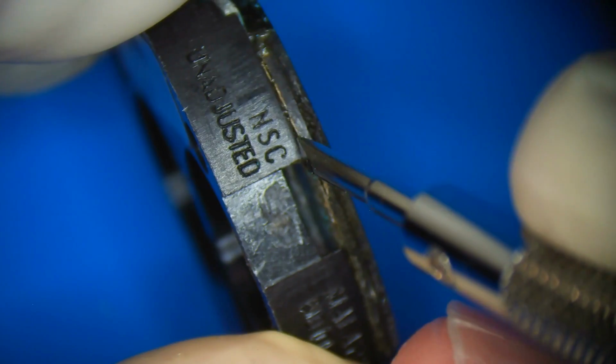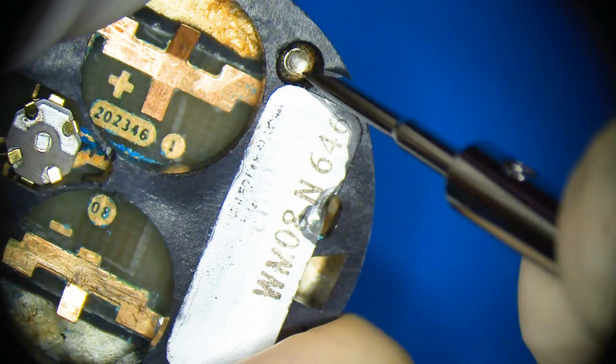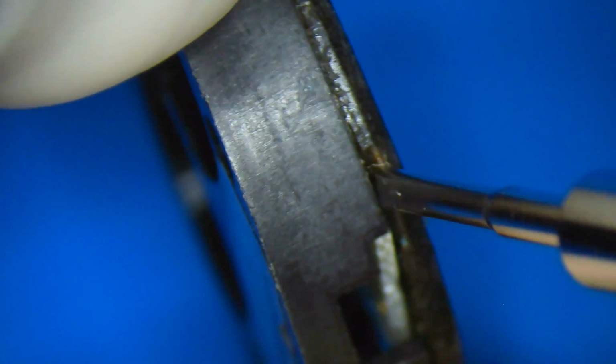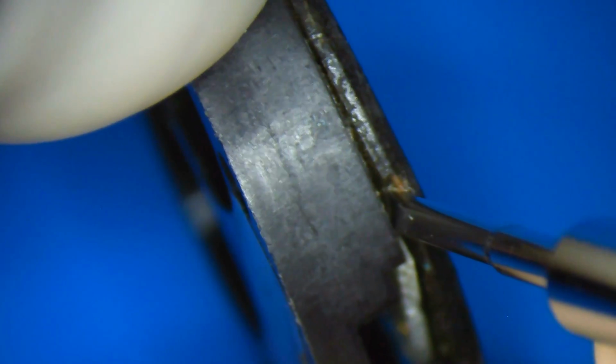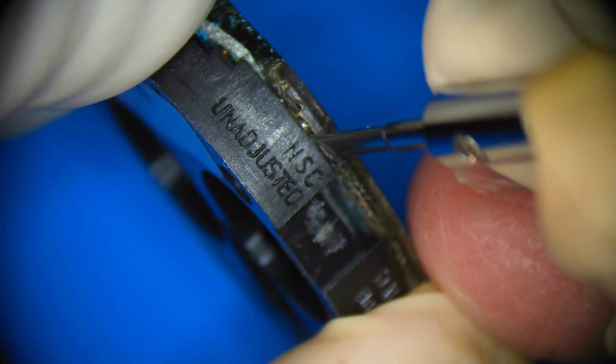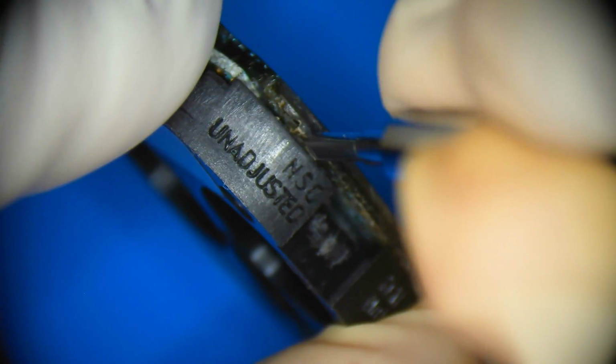The white powder you'll see on the outside of the battery is likely potassium hydroxide, which is the electrolyte used in alkaline batteries. When this chemical reacts with the copper circuits and components, either through direct contact or through off-gassing, copper hydroxide is formed, which appears as a blue solid precipitate getting on the copper parts and in the case.